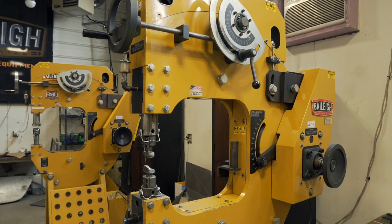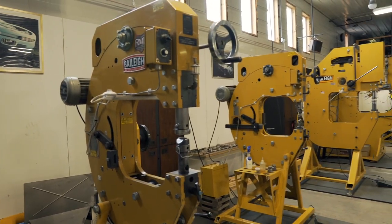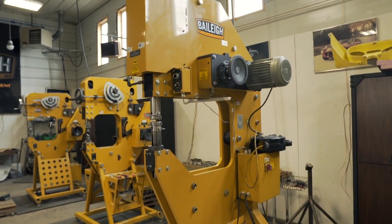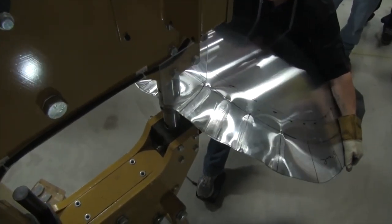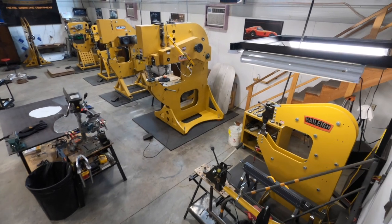This was the bread and butter machine. It's an MH19. This one can be set to run off of its spring like a normal power hammer, or it can go into a lock mode so it works like a pull-max machine — it's more of a reciprocating machine. This is the 28, another machine that I had something to do with, working with Chris Roosh from RMD, the maker and designer of all these machines. I had input on it. When we did the prototype, parts broke. The prototype had a different type of spring pack and design in it, and I kept snapping those leaf springs. He decided to go to a completely different system and that worked great.